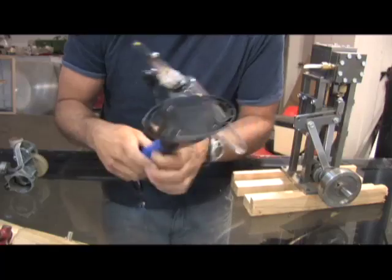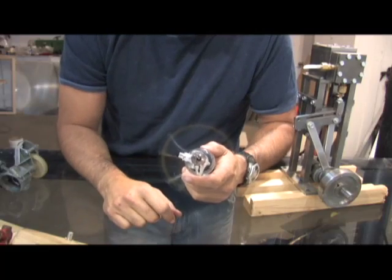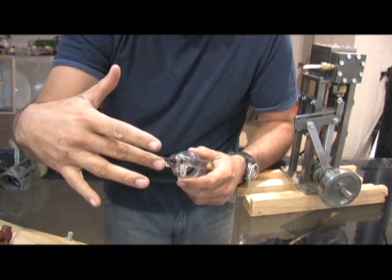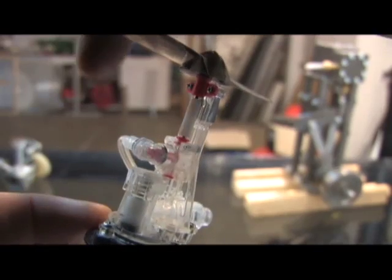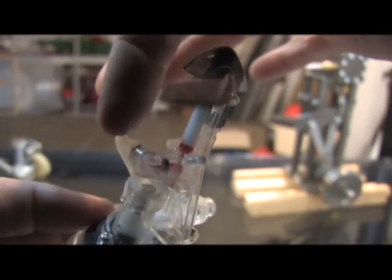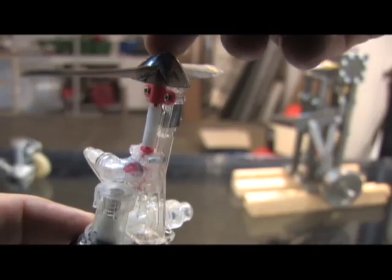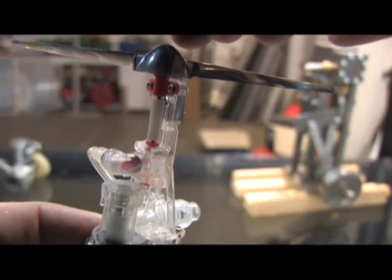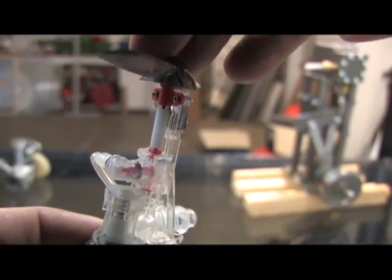What's neat about this engine is that the piston is only about an eighth of an inch across, and for that small of a piston it delivers a lot of power. Looking at it close up, that little tiny red thing with the black ring around it — that's the piston, and the black thing is the seal for it. The air comes in through the bottom, pushes in, and the piston goes up in a sealed position. This piston is fixed — it doesn't have a swivel. So as it comes back down through the quarter turn it angles, and this allows the air to escape. That acts as its own exhaust, which is much more efficient because the air is exhausting through a large portion of the cylinder with virtually no resistance as it comes back down.